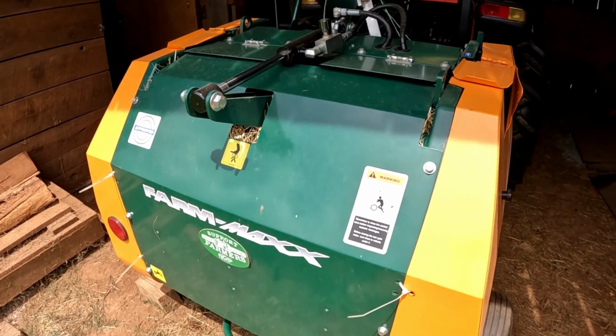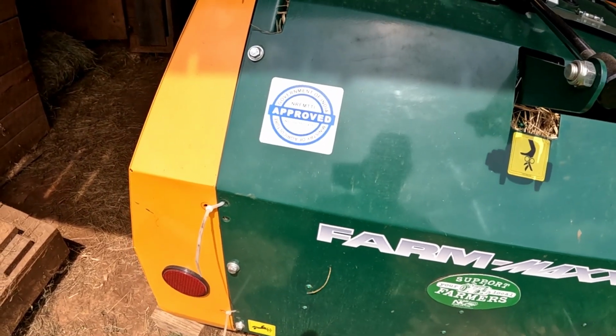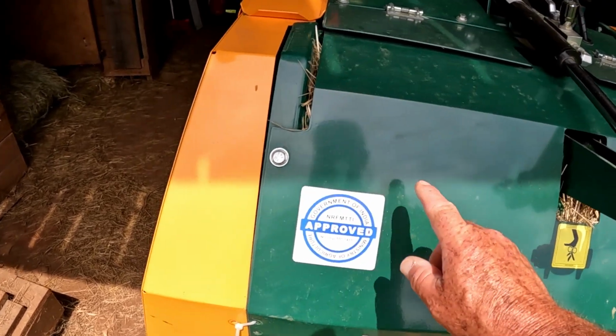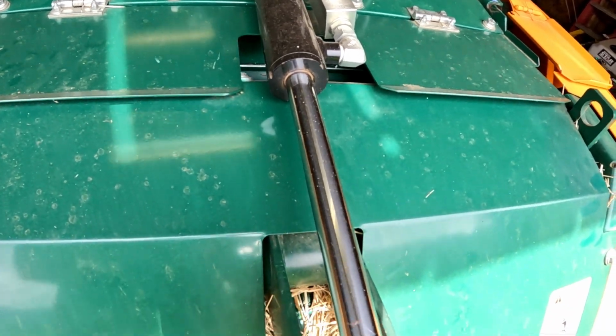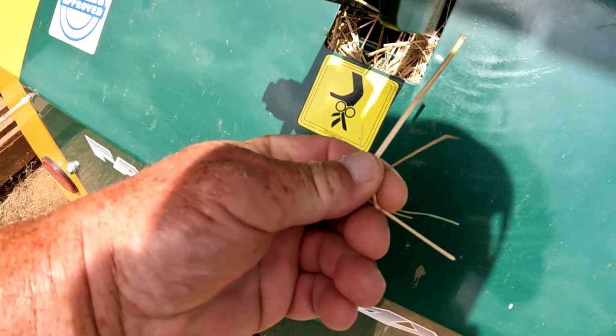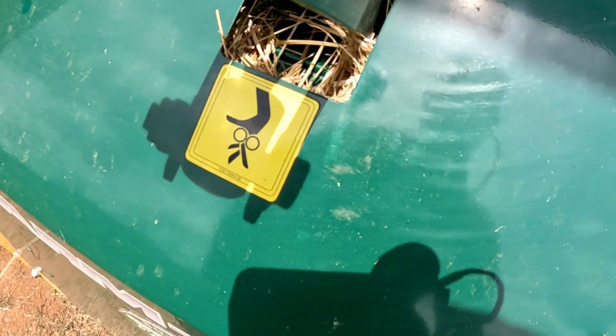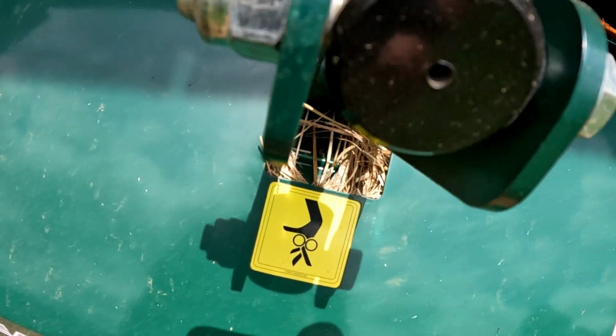Okay folks, here on your baler, when you're done baling, there's a few places you can notice that if hay's starting to get really compacted between this bale skin and the rollers. Right in this crack, look in there. Can you see that hay just compacted in there? Trapped right in there. Okay, right here where your hydraulic arm comes. Look how much hay's caught in there. Can you see that? And I've pulled out quite a bit of it, just by hand, reaching in there. But you can see right in there, there's all kinds of hay in there.